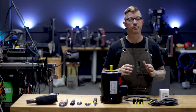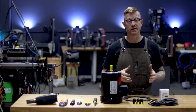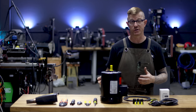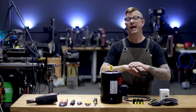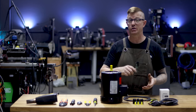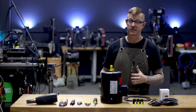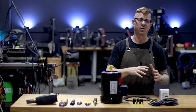We're going to use the KBAC 27D because it has the ability to run on both 110 and 220. A lot of people don't have a 220 outlet in their garage or workshop — they only have 110. Yes, this VFD is a little more expensive, but if you spec out what it would cost to have an electrician run a 220 outlet, you'll find this is actually a great alternative giving you the best of both worlds.